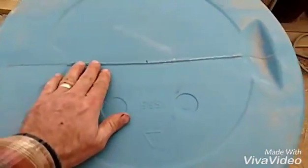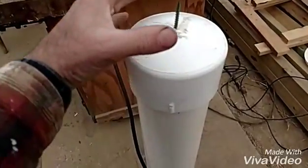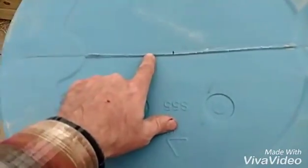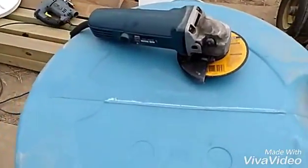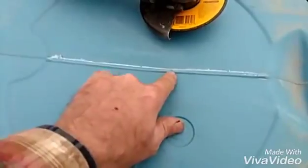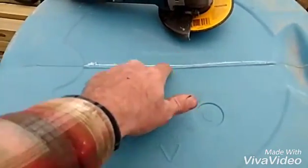The bottom of the barrel has got that ridge weld seam there — here's the center. I'm going to drill a hole in there and that will sit on this screw here to kind of keep it centered. I didn't do that on the last one and I had trouble keeping it centered as I was melting it to mold down over that — so this should help keep it centered better. Now first I'm going to take the little grinder and just grind that off a little bit, because I'll have to do that at some point when I go to put my bulkhead fitting on there. I'll just use the grinder with a metal grinding bit and smooth that out a little bit. When this gets molded out I'll be able to grind that off flush. For now that's as deep as I can go, so I'll put a hole in the center so it fits up on here.